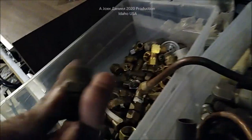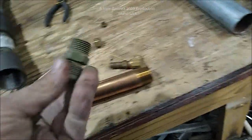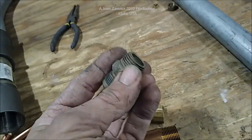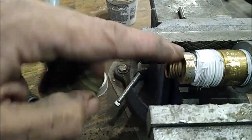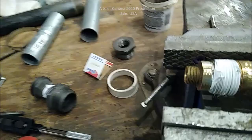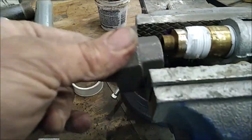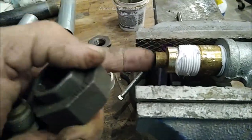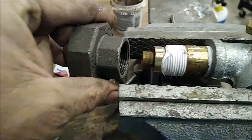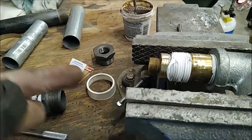So with a piece of three-quarter brass, you'll notice what's inside has a half-inch thread on one end and a 3/8 compression on the other end. You can use a flare if you like. You can see where I ground it off — that's so it can fit inside of here. This nut right here will thread on here, and this will be inside, and the union allows you to make all that up without trying to spin the pipe.